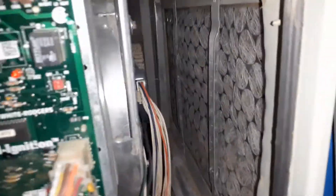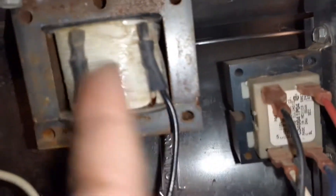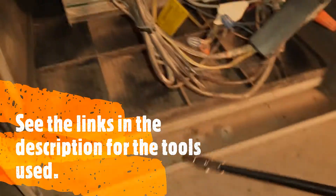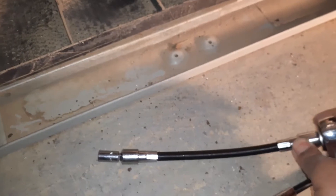I'm going to turn off the power to the unit and let the capacitor discharge on the blower motor. First I will remove the control panel - there are two bolts holding the control board. For the transformer, make sure the power is off; you'll have probably two bolts. When you are taking out the squirrel cage in the back it's helpful to have a flex extension. I will put a link on my video - these are not very expensive, you can get two for less than eight or nine dollars.